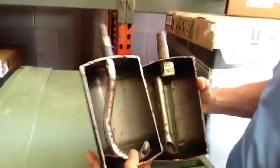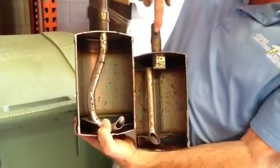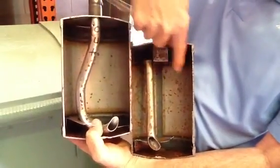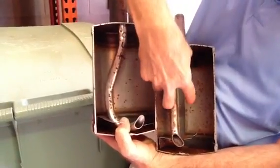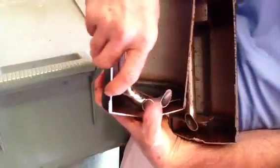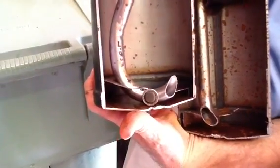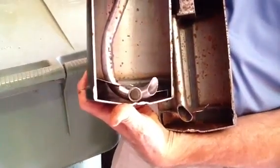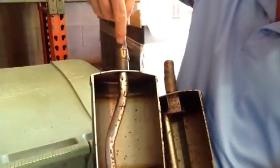What happens with your refrigerant: it comes in as a low pressure vapor. The vapor swirls around. There's going to be some liquid in here and some oil. The liquid and oil settle to the bottom and fill up. This metering device will pull in the refrigeration oil and the little bit of refrigerant as the compressor can tolerate. It pulls it up and very quickly sends it out to the compressor as a low pressure vapor.